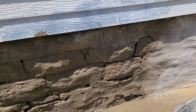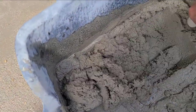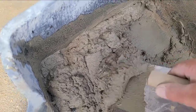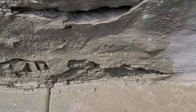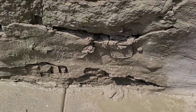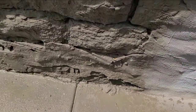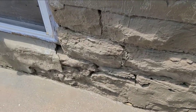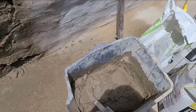Okay, I have the mortar mixed up. Let me show the consistency - it's like it keeps in shape, holds its form. What I kind of do is throw it in there like right in that indent and push it in. I'll probably use this triangle trowel tool down here. I can't demonstrate it very well with one hand holding the camera, but I'll toss that in, fill in all these voids, and work my way down. Then I'll make the next batch a little bit soupier and trowel that on.